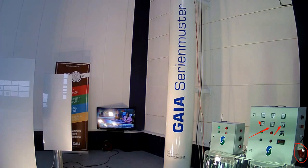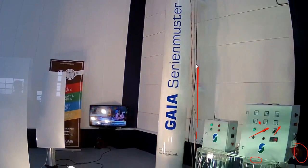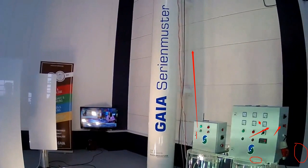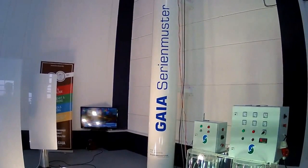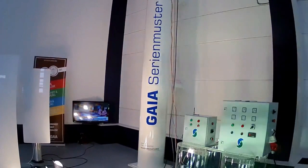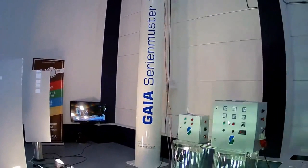Now the output is in this box here at the bottom. There was a cable up to this box here, and it doesn't change when you connect the heating panel to this box here. This black line goes to the generator, and the amp meters didn't change when you connected the heating panel to this box here. So there must be something wrong here.